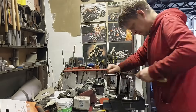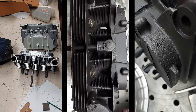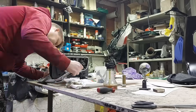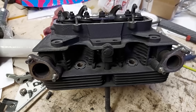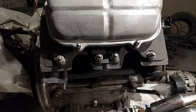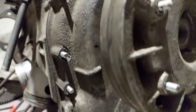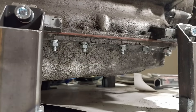Then I did the same to the second cylinder head and restored the exhaust ports. And then it was time to paint and assemble those heads. The paint is, by the way, heat-resistant and good for aluminum. Then I replaced all of the case screws with studs. Screws react with the aluminum magnesium alloy, making some white dust – they stick as hell. Soviet quality, ladies and gents.